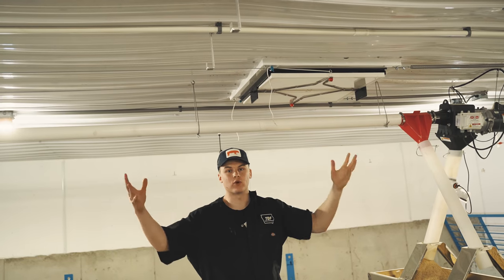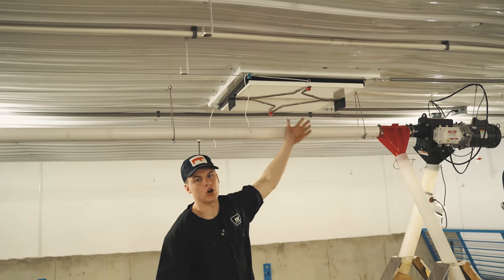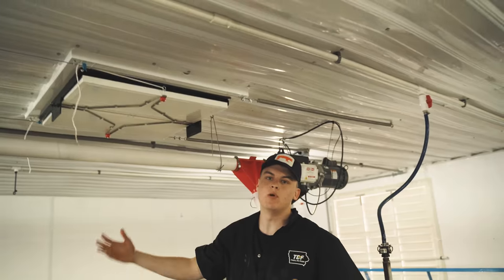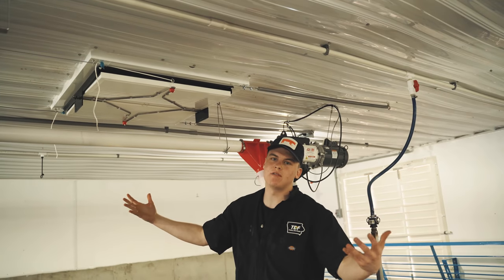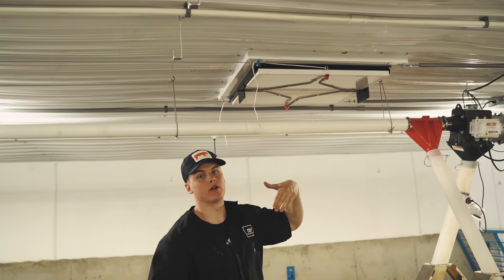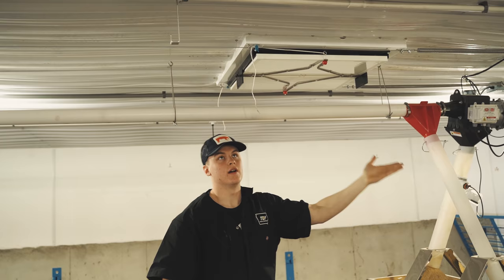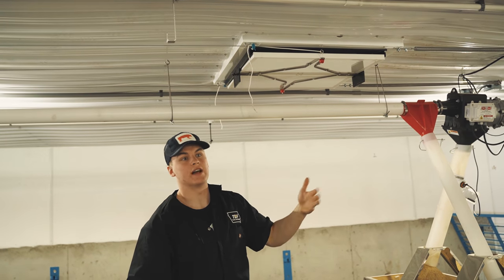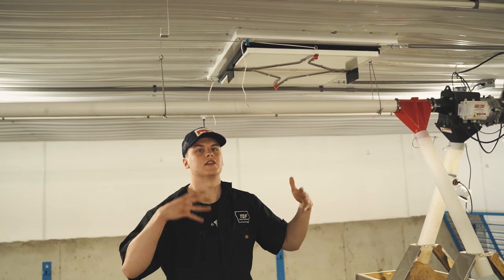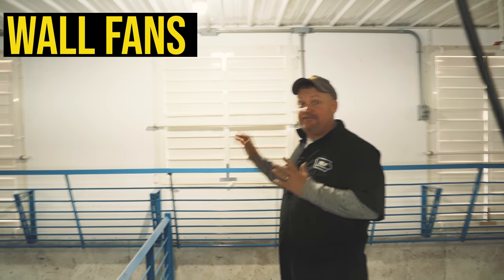Right here is what we call an inlet. There are 22 of these per room, 44 total — these are AP inlets. We really only use them in the winter months and when starting pigs. As you can see this one is open about half an inch, but when you have 22 of them it makes a big difference. The control knows how far to open or close them depending on the stage of the pigs' life — as fans open up, these inlets open more, and as fans shut off, the inlets close more to keep air right and hit our target barn temperature.